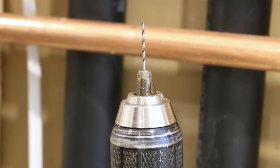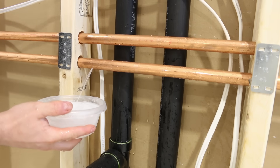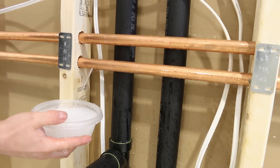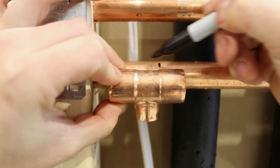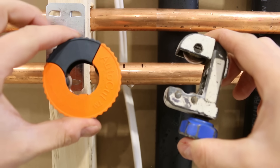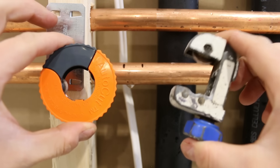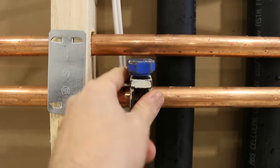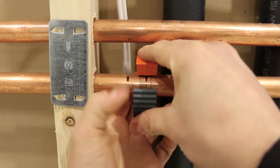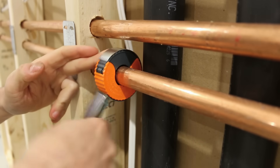If you're working in the basement, you could drill a small hole where your new fittings will be to allow most of the water to come out, since you're at a lower point. When there's no more water coming out, use the fitting to mark where the cut needs to be made and make the cut. I find that using a compact pipe cutter is so much easier than traditional ones, especially in confined spaces, and you can get a ratcheting handle to make the job easier without sacrificing space.